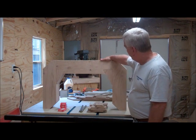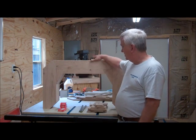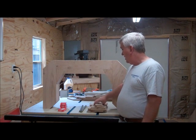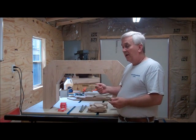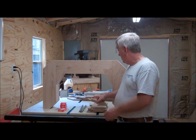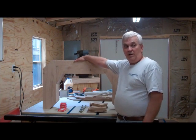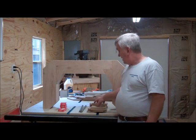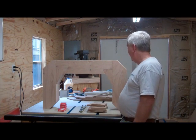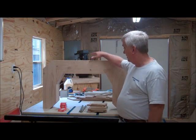When I was cutting the plywood parts for this C-frame, I used some MDF as templates and that worked out so well - everything fit really nice. So I've decided to continue that same practice and yesterday I was cutting some of these templates that I'm going to use for some of the other parts. While the CNC is running the sawmill wheels, I'm going to be laying these out, cutting them on the bandsaw, then using these templates to flush trim them and I should get some really, really nice fits. Basically it's going to look like everything was done with the CNC because all the parts will be exactly the same.